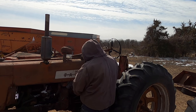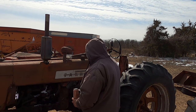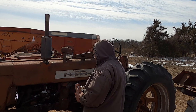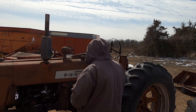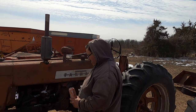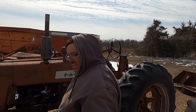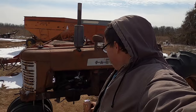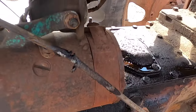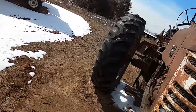Well, that's not what we wanted. Good thing we had some Monster, huh? That saved the day. Saved the day in a little snow. So it looks like they got the choke wire ran right next to the starter. So when I went to pull the choke cable by hand, it touched the choke cable right up in there on the positive side. Started on fire.